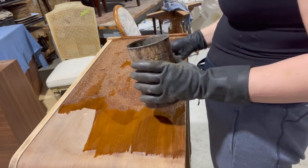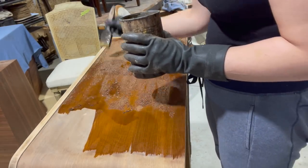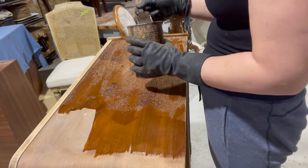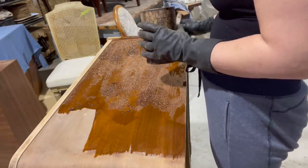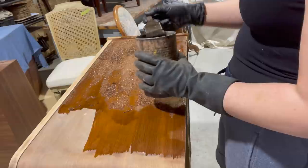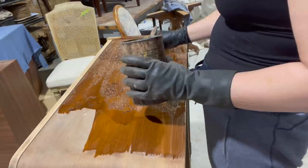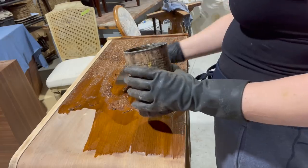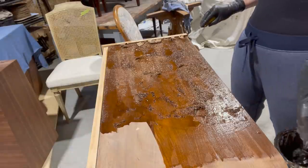And it's just needing to come off or else my, well, it's rough for one, but also my lacquer paint won't adhere to this bad finish and it'll look super uneven. So sometimes you just gotta take it right back down to the wood and then I'll do some sealer coats. If someone did want to refinish this back to the wood, they would have to do a lot of veneer work, but at least all the surfaces are prepped. Okay, and we'll scrape this off.